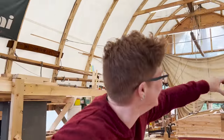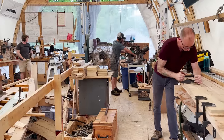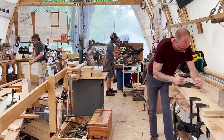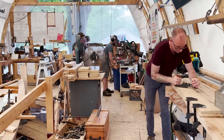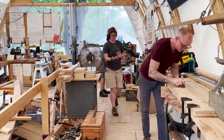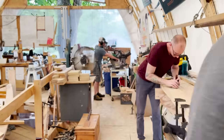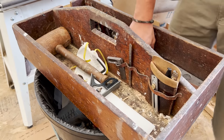With all the extra help, Steve had two free hands to take on a small project that will be nice to have done later on. Here he's getting started on some butt blocks that might be needed when the deck is laid, but will definitely be needed to provide backing for any hardware that gets fastened in an area of the deck that would benefit from more support.